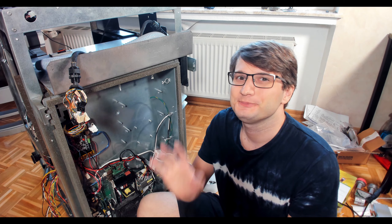To accommodate both American and European markets with different voltage standards, Stratasys went with a high-voltage power supply so the machine can operate from 100 to 250V without needing to change heaters or anything. This ends up being handy because the heaters are 120V. I'm not going to use the original extruder heaters — I'll change to 24V since that's what E3D supplies on their extruders — but for the chamber heaters I'll keep this power supply so I don't need to change anything or make a current control loop.